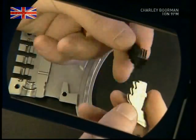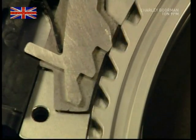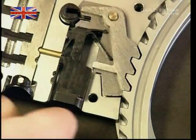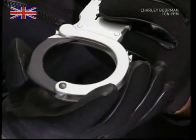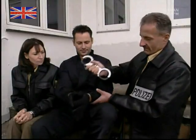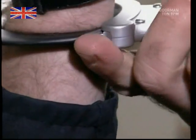With the arm finished, the construction of the internal locking system can be completed. A variety of extras have been added to address the old problems. These nubbins can be used to lock the cuff arms so they can't be over-tightened. Old-fashioned cuffs could be easily undone with a paperclip, but the use of three locking levers has made the new model much harder to pick. The locks are accessible from both sides, meaning the cuffs can never be put on upside down. So a complete makeover means this new style of manacle is easier for police officers to use and safer for any suspects restrained in a pair of the latest high-tech police handcuffs.